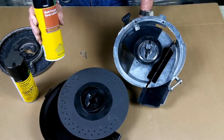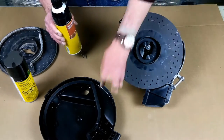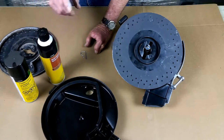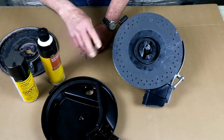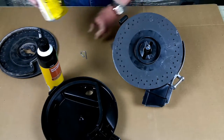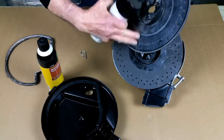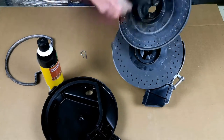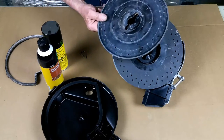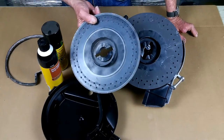A couple of things to mention: the multi-purpose spray lubricant comes in handy if you're having trouble getting the new seal back into the housing — just spray the seal down a little bit, put it into the housing, then wipe it back off. The graphite is actually used on the back side of the seed disc to cut down on wear right there. Just spray it on, let it dry, and it'll cut down on wear on the seal and on the seed disc. Thank you for watching — hopefully it helps.